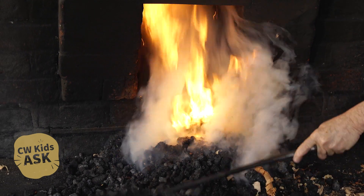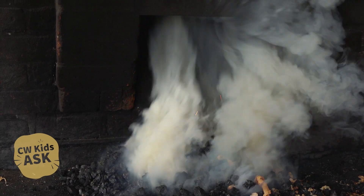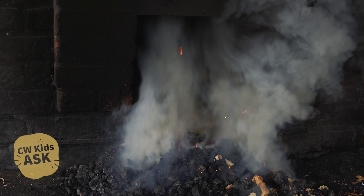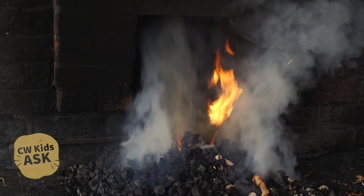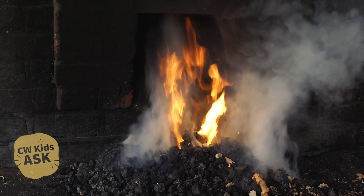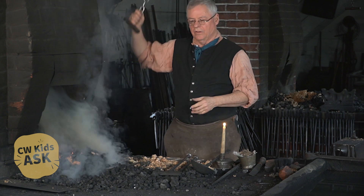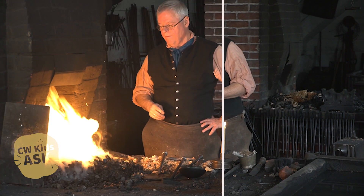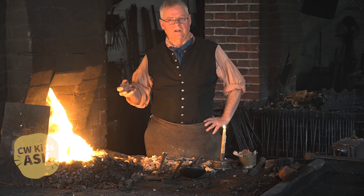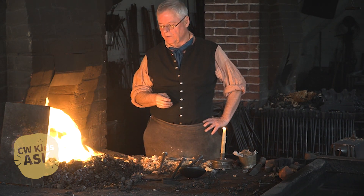As we start a fire, you'll also see that before the fire builds up heat, you get incomplete combustion — that means you produce a lot of smoke. As the fire gets hotter, you'll get more complete combustion, which means more flame and less smoke. Another scientific principle you notice is that hot air rises. And you can hear how when that air blast stops, you don't get as vigorous combustion — it doesn't make that same roar as when you're fanning it.